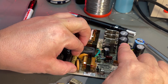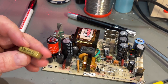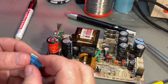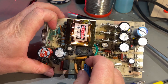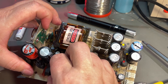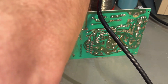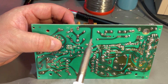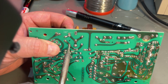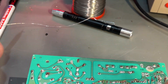By the way, I did short out these electrolytic capacitors before I started working on this. For the big 100 nanofarad one I have this replacement — it's quite a bit smaller. I'm not really sure if I can fit it, but there seem to be holes for narrower types of caps so that should fit straight in. I just need to use my soldering iron to open those holes — there you go — then some flux.